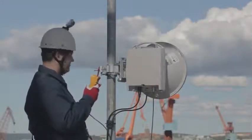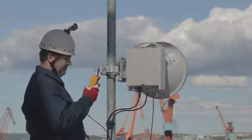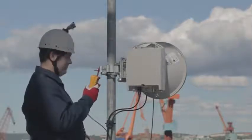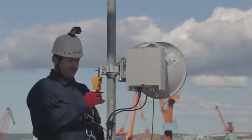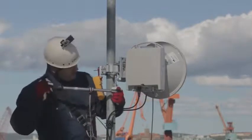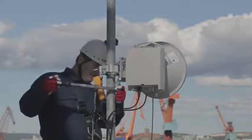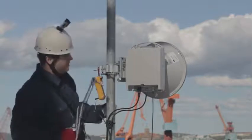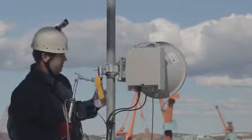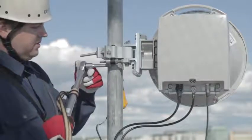The fine alignment procedure is now repeated at the far end, and this is seen at the voltmeter in your end of the link. Make sure that both antennas are aligned to give the maximum voltmeter reading. Now you should have reached the expected receive signal strength given in your site installation document. Tighten all the screws using a torque wrench, making sure the antenna doesn't move while tightening. Have the voltmeter connected and check that the reading does not change. It is a good idea to tighten the screws at one end at a time — this way you know which antenna has moved if you see the voltmeter reading change. Also tighten the azimuth adjuster nuts.